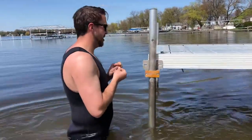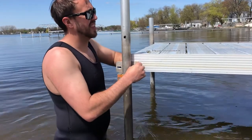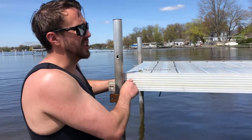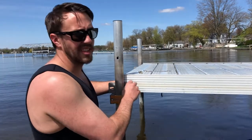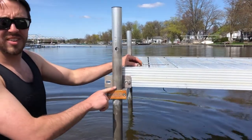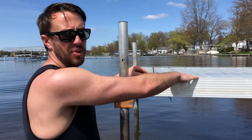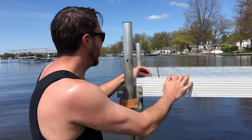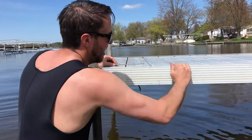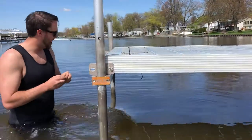It's a nice calm day, but usually it's a little windy out here. You can see all these poles, and the dock has a slight discoloration. This one is on a very flood-prone lake — it has gone underwater a couple times, which is not something you want to do with an anodized dock. You can see it's much more resistant. Everything is raw metal, so if you have a mill finish dock, that's kind of what it turns to. The anodized always stays cool to the touch — it's about 40 degrees cooler than a wooden dock. This lake has some kind of dust or mineral in the sediment that comes out of the water and turns them kind of white.